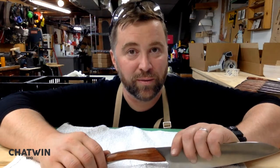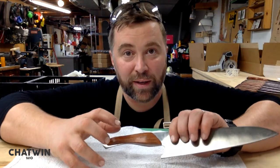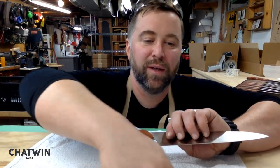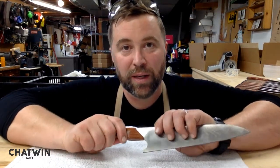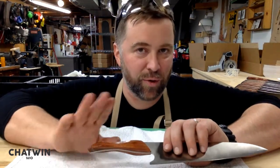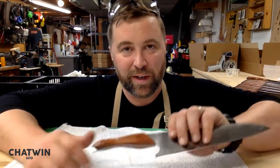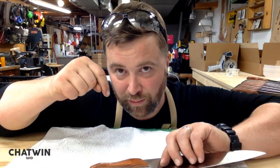If you put it in a dishwasher and the dishwasher is really, really hot, you'll realize that it'll start swelling, and the swelling doesn't go away, and it'll bleach, because boiling water just makes wood very unhappy, and it might even warp, and then it might become a wobbly handle, and it's just not good. So don't use them in the dishwasher. Just hand wash them in lukewarm water, and you're good to go. Then you can put the oil on anytime you feel like it. If you dip it in oil and let it sit there and soak in, it'll probably darken more. The oil might penetrate a little deeper.